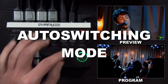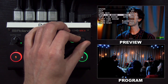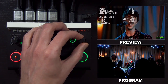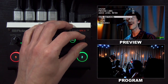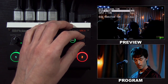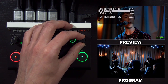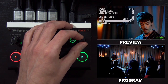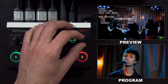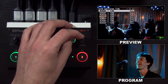If you want to automate your video switching, there's also an auto switching function in the system menu. Go to page three and turn on auto switching. The default is input scan, and every five seconds it'll go between inputs one and two. You can change this for each individual input, as well as the length of the transition time and whether it's a mix dissolve or wipe. You also have an option to go between preset memories, so if you have several memories set up, you can cycle through those as well instead of just the inputs.